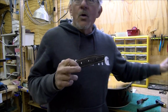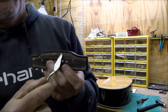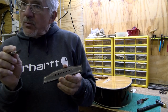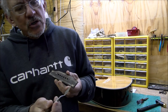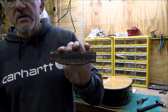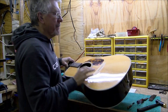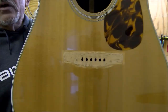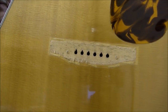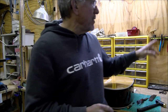That's untouched. You can see on this bridge where the finish is and where the bridge is - there's a clear line running around here. That's where the finish was; this is the glue right here. So you can see that the footprint is quite a bit smaller than the footprint of the bridge - you're losing an eighth of an inch all the way around on this. I've seen some that go a quarter of an inch; it varies a lot. So there's our bridge off, and here's the top of the guitar.